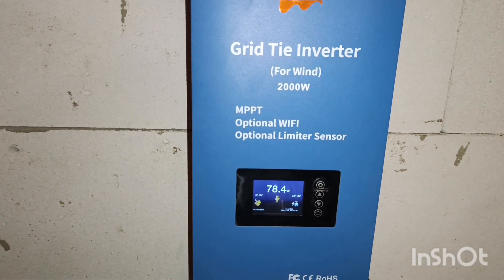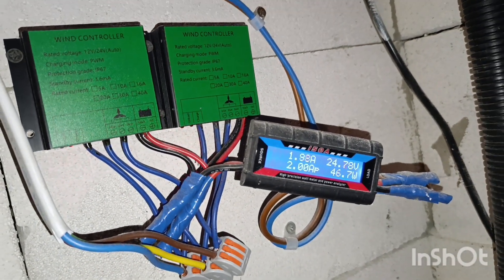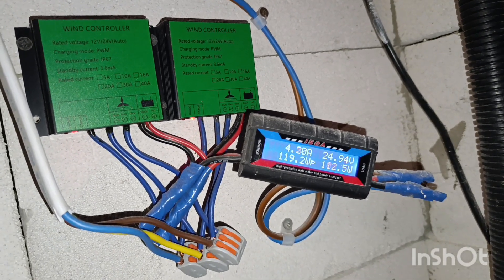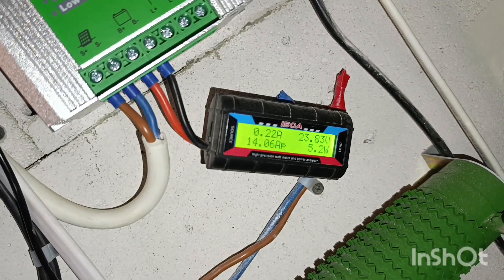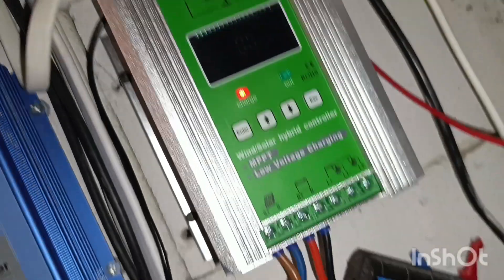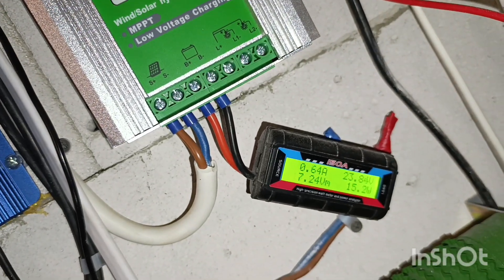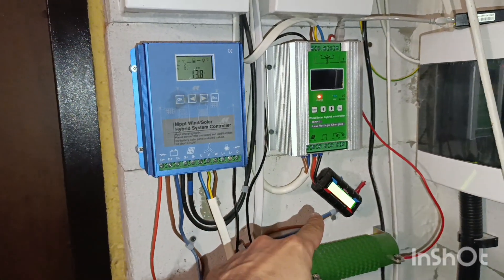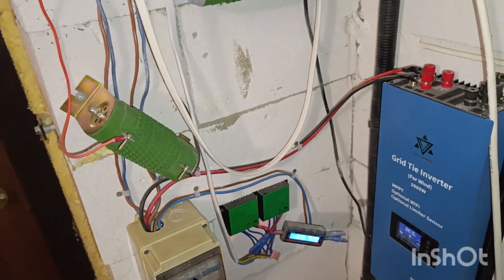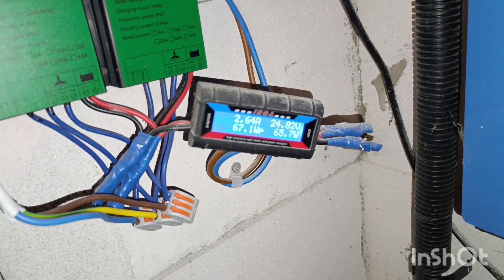The wind slowed down — it was just shooting 1500 and now it's 140, 100, even less. This is how the M3 goes — at the moment when the FT was showing nice amounts, the M3 was showing 250 to 270 watts. That's the difference from the bigger wind turbine. This is the self-made with the MPPT controller — it works quite strangely but it just works. It has much lower height — the self-made 1.65D sits at five meters above ground and this one sits at 10 meters, and the difference is massive: 30, 40, 50 watts versus 60, 70 — roughly double the height and double the production.